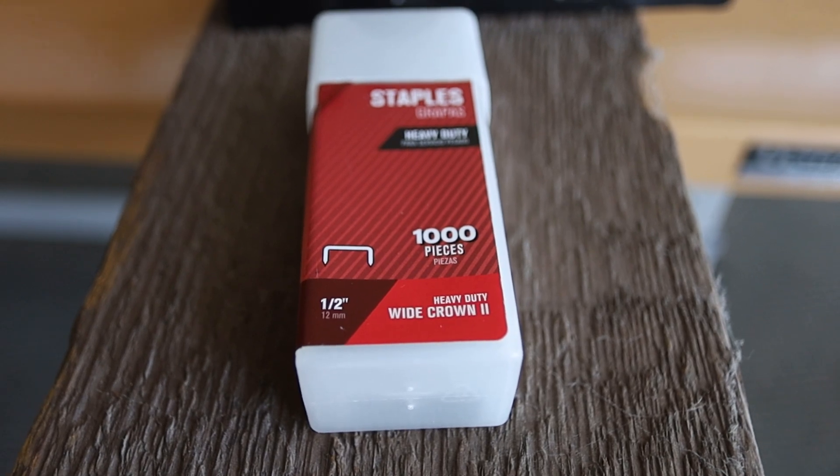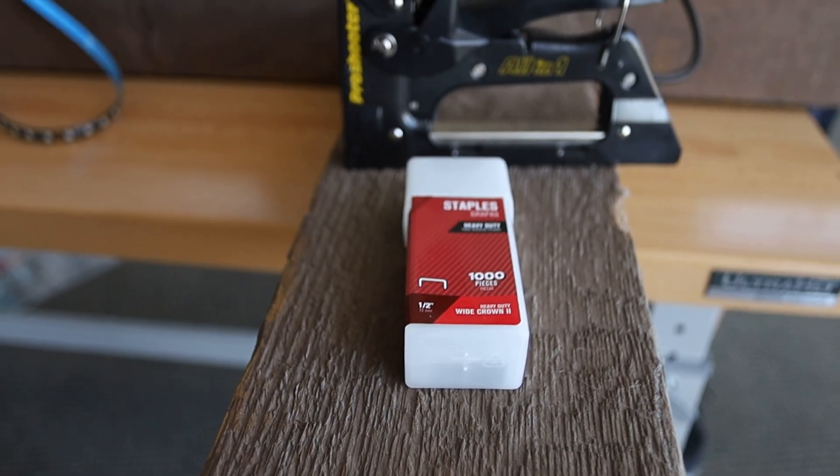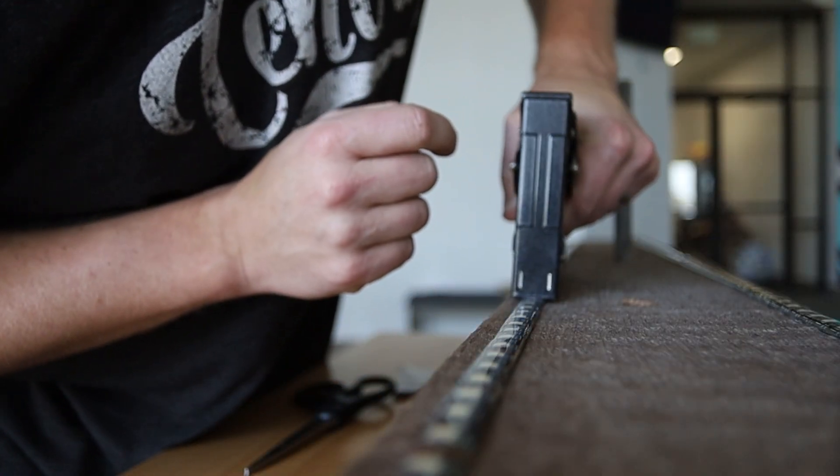If you've done any work with LED tape over the years you know that gravity is your worst enemy. What I've learned and grown to love is using wide crown staples — they don't work in all staple guns. Really the only one I've found is this pro shooter all-in-one. Wide crown is super important because it just barely fits over the LED tape. So carefully we secured those to the back of the cross using staples combined with the backing tape that's already on there, but for wood like that the backing tape really isn't going to do much.